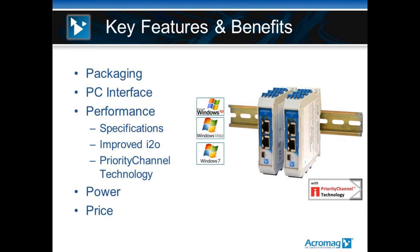This unit is mounted on a DIN rail, and every unit is shipped with a bus power connector that snaps onto the rail, allowing customers using two or more modules to plug them together. These modules can touch and plug together down at the rail to build a power bus. If they want to take advantage of that power bus, they buy one optional kit that includes three pieces: two screw terminals that go onto each end of the power bus, and a spare piece for the middle if needed. That low-cost kit allows a customer to land power down at the rail.